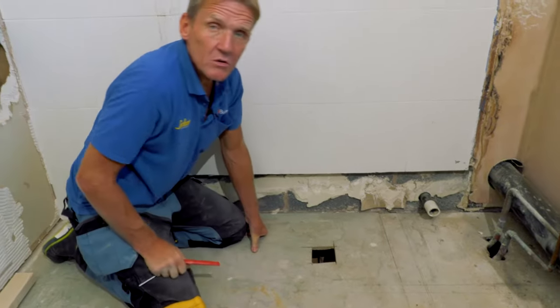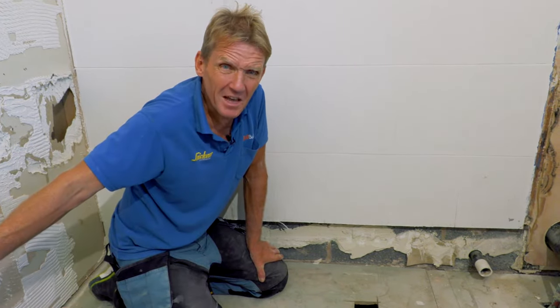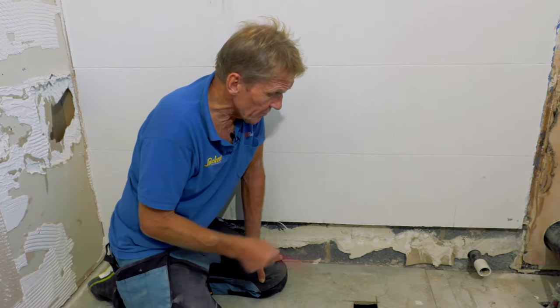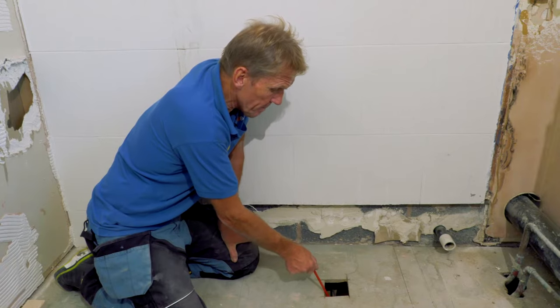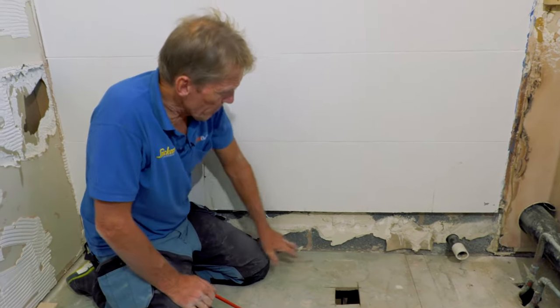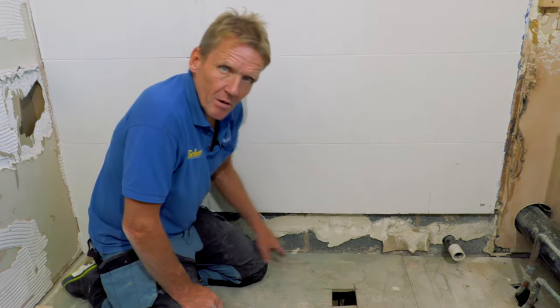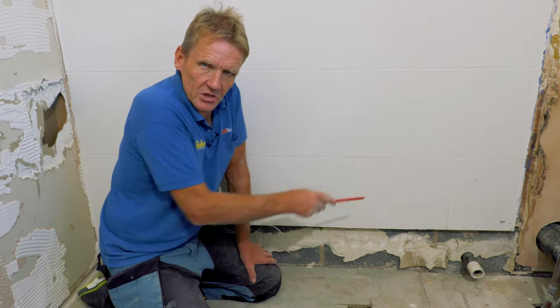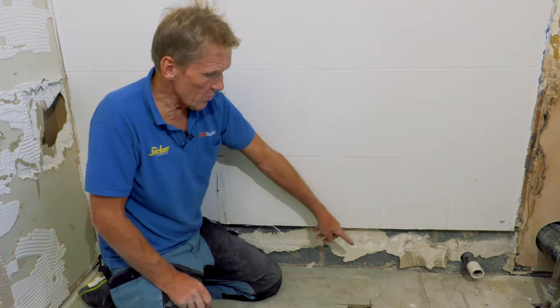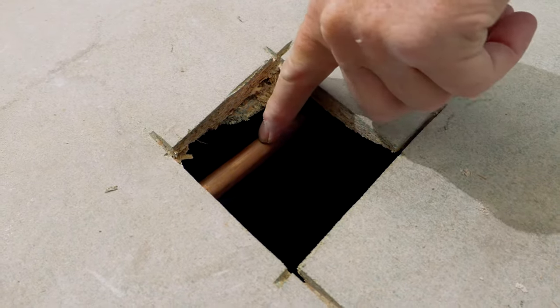So you think, well, what else is there in the bathroom? Okay, there's heating pipes for the towel rail, but I'm reckoning they're going through that doorway. So what else have we got here? We discover another 15 mil pipe here. And that really baffled me, because it actually goes into the wall there and then it disappears. It doesn't appear outside. And then I went downstairs, I discovered there's a gas hob right in the kitchen below there. So this pipe here is actually a gas pipe.